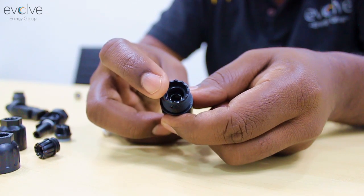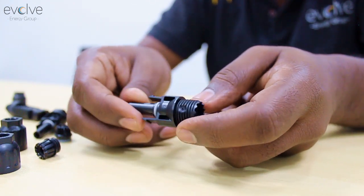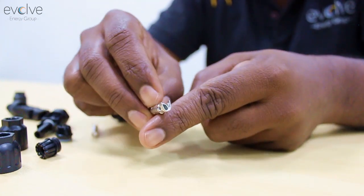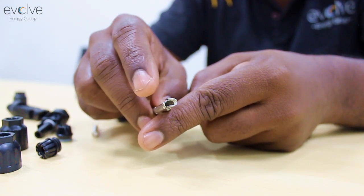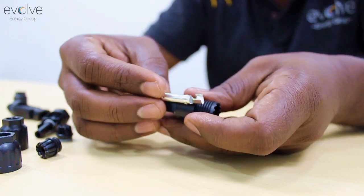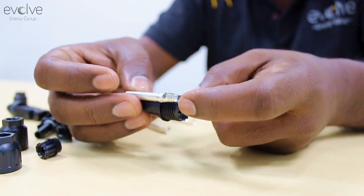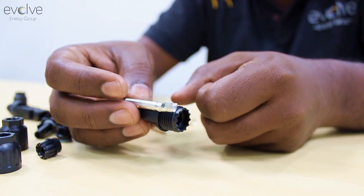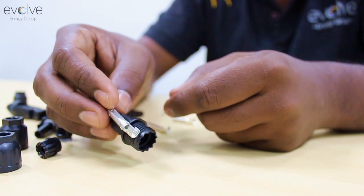Adding to this comes the time for installing the product. Even though this product is of good quality, it comes with a metal connector that requires a crimping tool to make a good contact with your cable — for a 4 square mm or a 6 square mm cable. In a bigger plant this can increase installation time, and if there is improper crimping done by a person working on site, that can again create an issue in spite of this being a good quality contact.